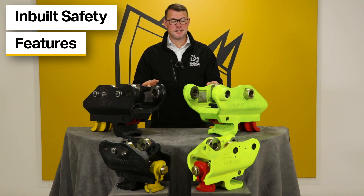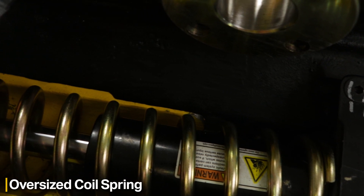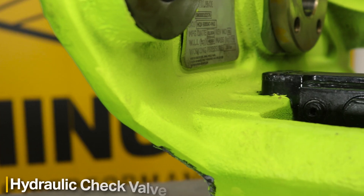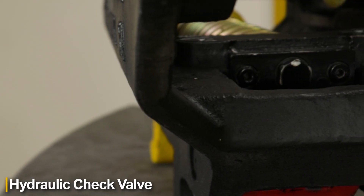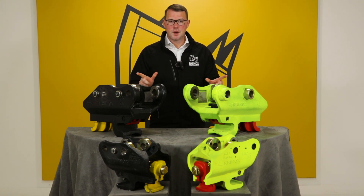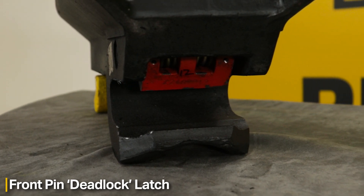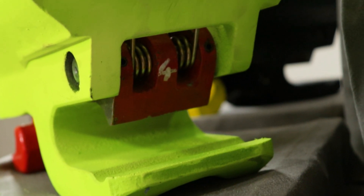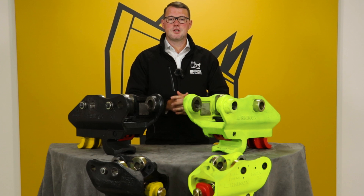The built-in safety features of the HQX include an oversized coil spring inside the hitch that maintains positive pressure on the latch at all times. There is also a built-in hydraulic check valve as a safety backup, ensuring pressure is maintained in the hydraulic system in the event of a failure. Additionally, a deadlock latch at the front means that once the front pin is located on your bucket or attachment, it restricts detachment — so even if the back latch isn't secured, it is impossible for the front latch to release the bucket or attachment.